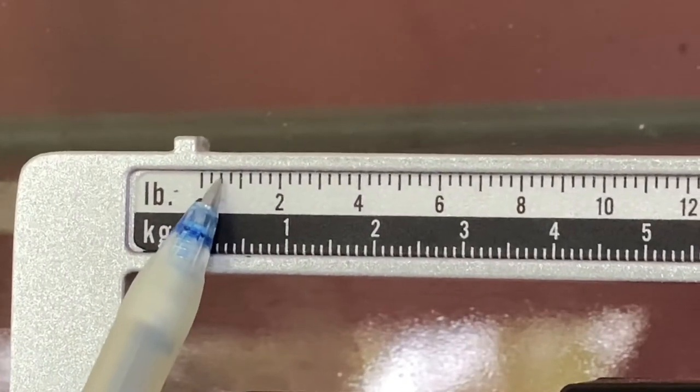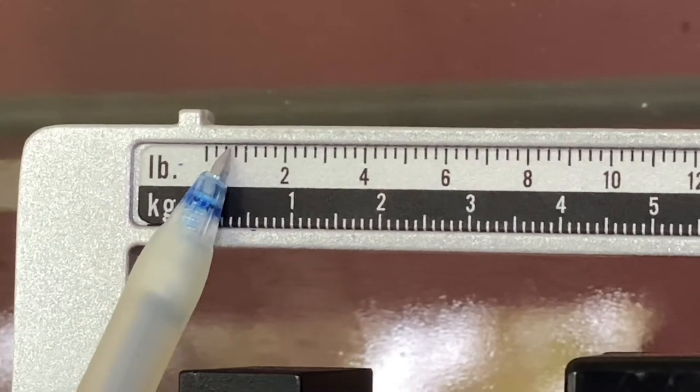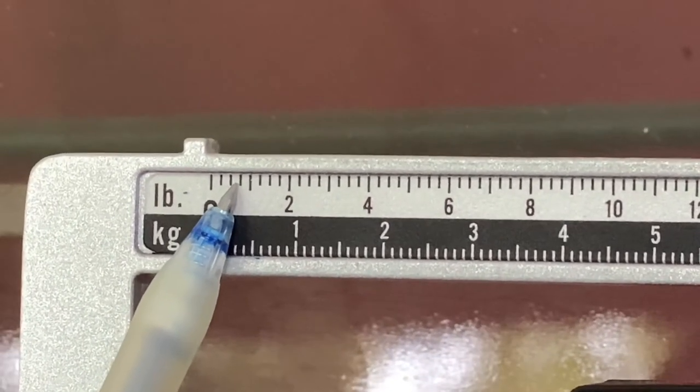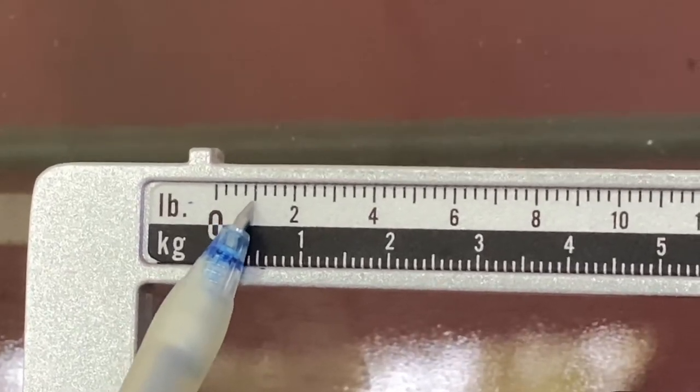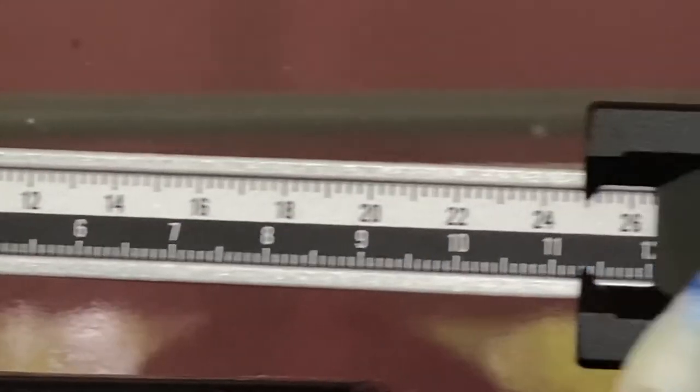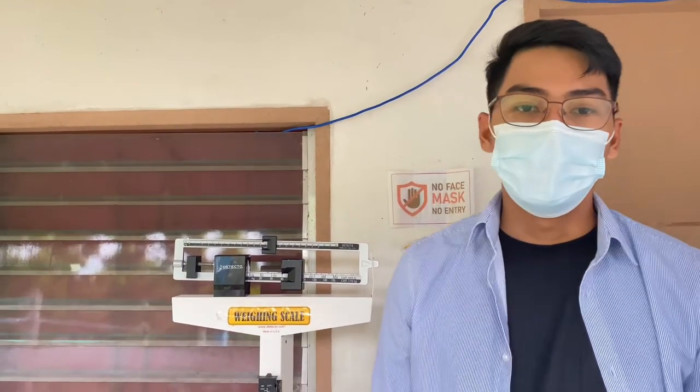These lines represent fractional numbers. The first line in the quarter is 1/4. The second line is half, and the third line is 3/4 in the quarters. This is constant throughout the entire scale. And there you have it. You have learned to interpret the calibration markings on a precision mechanical beam scale.